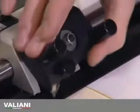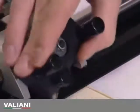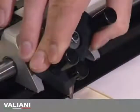Adjust the blade depth if necessary by unscrewing the black screw, changing the blade depth with the aluminium screw, and tightening the black screw again. Repeat these steps until the blade cuts as deeply as shown into the slip sheet.